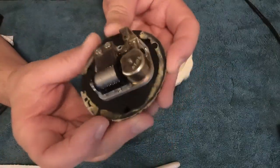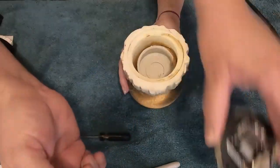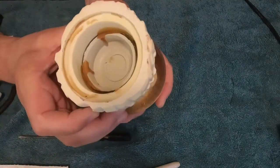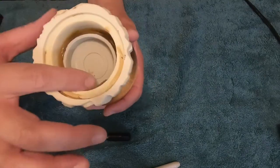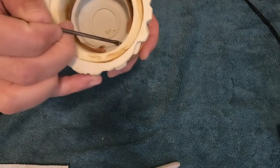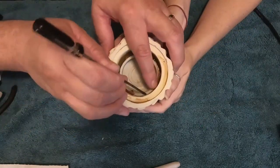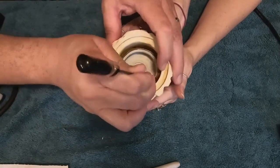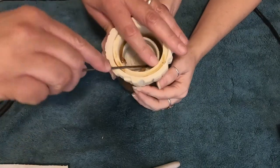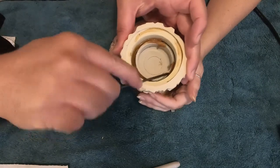There's the music box inside the cover — it looks good. The winder's gone but we'll be able to test that later. Here's the inside of the snow globe and you can see the rubber cup inside the opening. It looks pretty good — there's not a whole lot of glue. Sometimes there's a lot, sometimes there's not, but this one looks pretty good. We're going to take this little screwdriver and separate the rubber from the glass globe all the way around, just making sure it's loose.